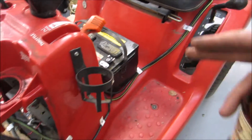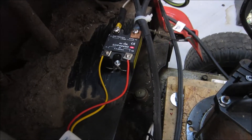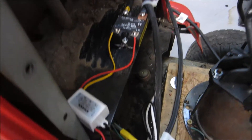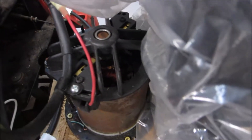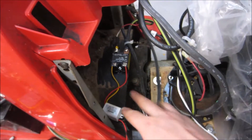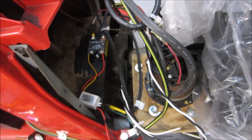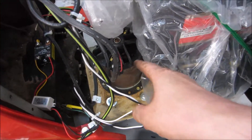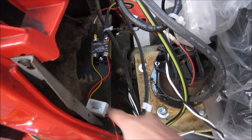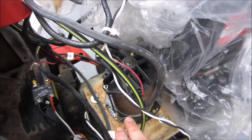The power coming out is very dirty — the solid state relay can't even stay on; it's actually on-off-on-off fast enough that it's visibly shaking the motor. I tried a few different capacitors and none of them really fixed how bad the supply is. The Arduino Nano regulator itself might clean it up, or this motor may be causing inductive effects with the series batteries. For now I'm bypassing pulse width modulation for testing.